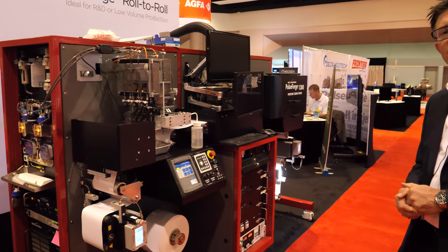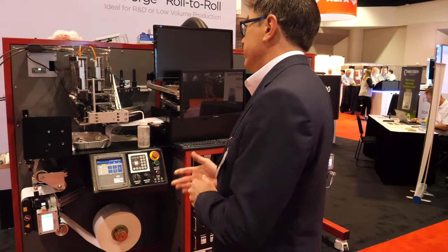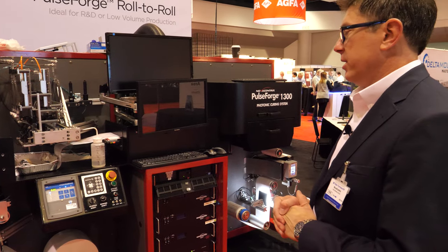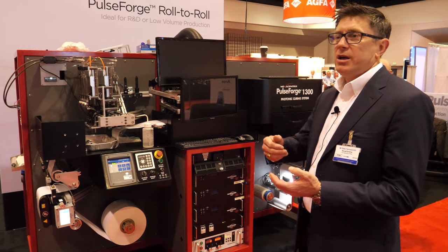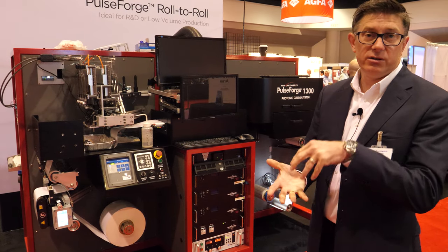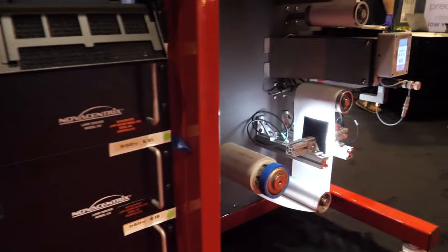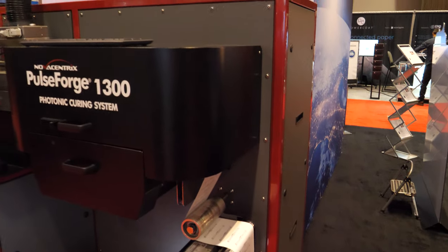This is a really impressive machine in this industry. What have you been mainly doing the last few years? Over the last couple of years we've been working on getting the reliability of this system really tuned and we've learned a lot. We've learned about the need for material compatibilities, how to drive the inkjet heads to deliver the right amount of ink onto the substrate, and updated ink formulations that are easily printable with the inkjet heads while also having good adhesion to a range of substrates. What this represents is system-level integration — the material, the equipment, and the know-how all coming together.